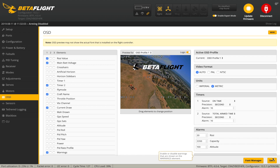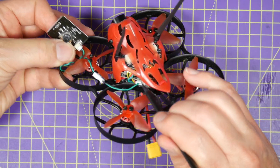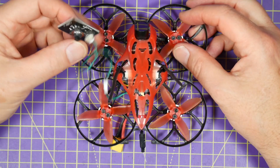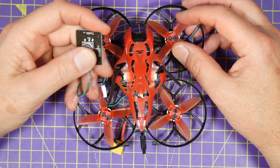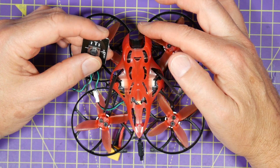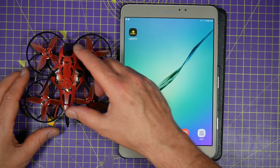So we can go out and fly that. To configure the FPV camera — the bottom sensor — just plug in the OSD joystick into the bottom connector on here, apply some power, put your goggles on, and press the joystick in the middle and just go through the menus and set it up as you want. The great thing about having a dual sensor is the setting you have on the FPV camera is only on the FPV camera, so just set it up to how you want it.